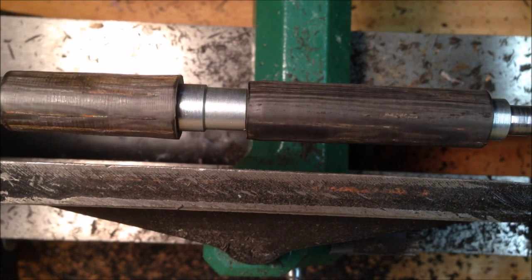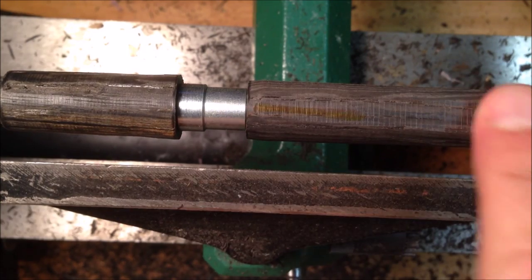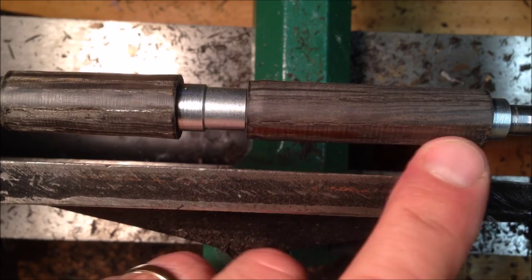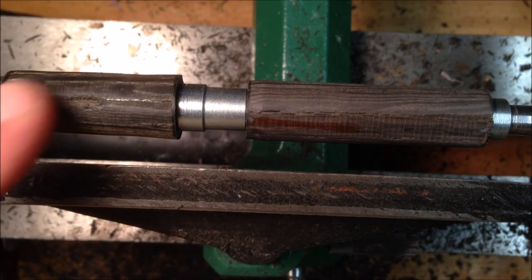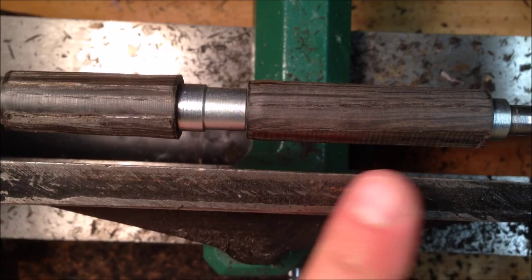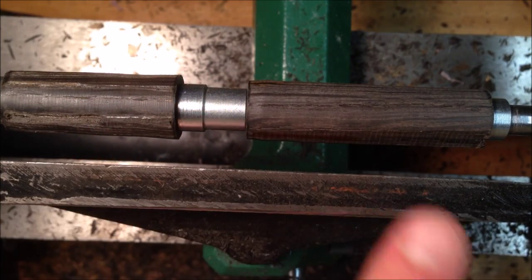It wasn't too bad — truing it up went pretty good. I still have a flat spot on this blank, it cut kind of close, but I got quite a bit of lip there so I should have no trouble getting that down to the proper size of the bushings. This one's got a kind of a rough spot in it back here, but it looks like it's not a whole lot deeper than the bushings, so I'm going to try turning this down a little more and just continue to go slowly.